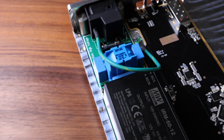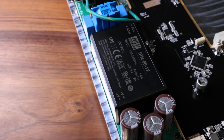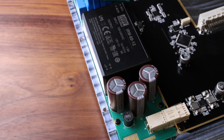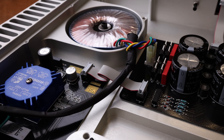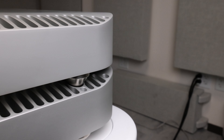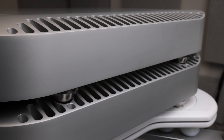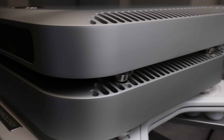The Digital Director is offered in three main levels: the Select, Reference, and Premiere. The Premiere is a more compact design featuring a switching power supply. The Reference and Select levels feature a custom-built low noise linear power supply. Both the Reference and Select Digital Directors feature the same electronics internally — the only difference between them is a chassis design to match their DAC counterpart. The Digital Director should be viewed as a DAC upgrade.